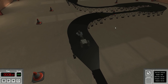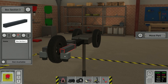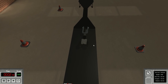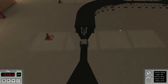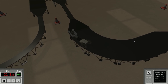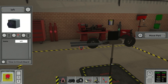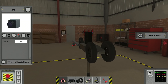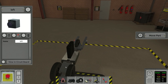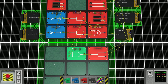We drive right off the edge - at least it steers correctly. We just need to reposition the sensors. It did the first part - is it going to stay on for the next part? No, the sensors need to be even further forward. Hopefully this is enough. Turn - okay, good, barely fitting on that balance beam. Oh perfect, it just hugs that corner! Is it not enough? It is okay. After a bit of testing we've got a working design. We put two single motors on the back to make it even narrower, extended the front for sensor positioning.